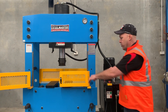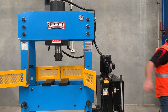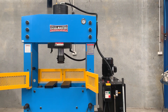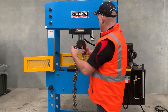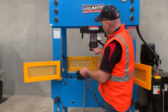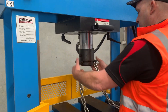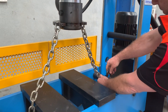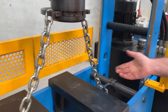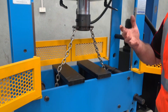I'll just show you the lifting mechanism there as well, pretty quickly. We have these chains here — it's a nice simple operation. There's a groove there, so we just put that in there, put those down here and then down here. If you're looking closely, you just hook those there, then retract the ram back up, pull your pins out, and you can raise and lower the table.